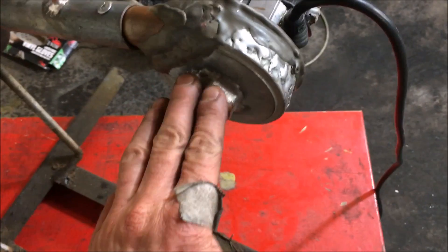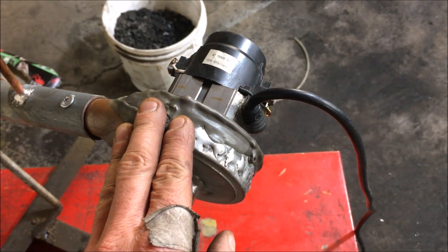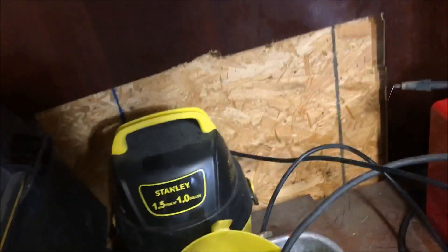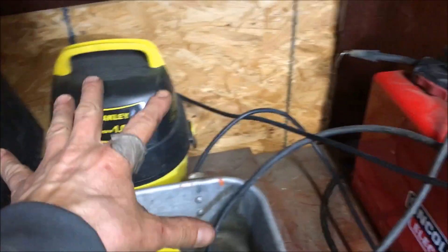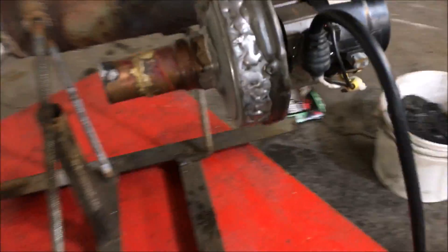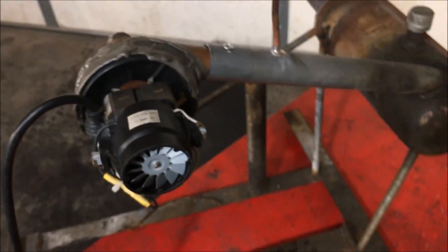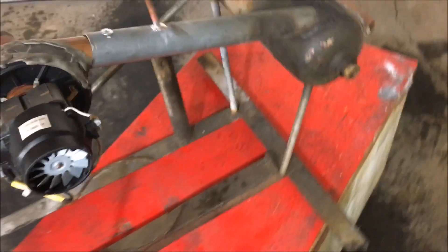This blower can be obtained from a Stanley vacuum cleaner for 20 dollars — a fantastic find at Menards or Lowe's, runs about 20 bucks. You take that apart, do some simple modifications — you can see I've done a little bit of soldering and some JB Weld. With just some minor modifications, what you end up with is a nice little blower motor with a built-in cooling fan on it. You can't beat that for the price.